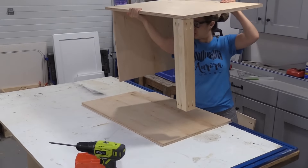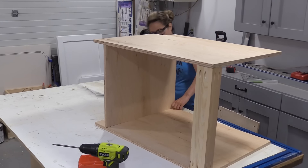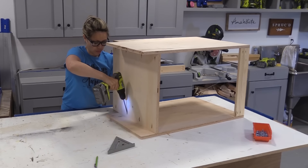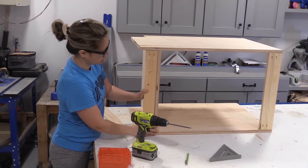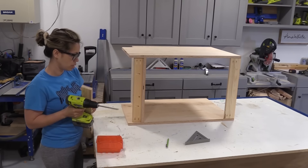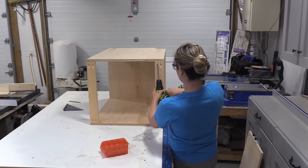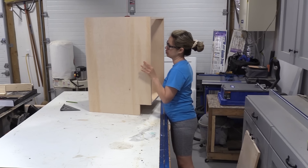The kitchen cabinet is actually very simple and easy to put together. The big thing is make sure those plywood cuts are perfect, because it will be the biggest factor in affecting the quality of your cabinet as far as construction goes. Then I add what I call base supports, because it takes the place of adding more plywood but provides that structure to make a nice high-quality cabinet.